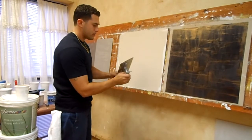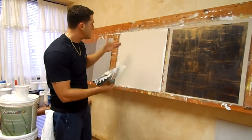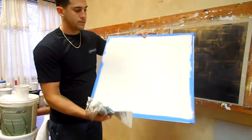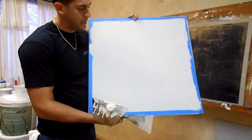Now we're going to wait until this dries. I'm going to do a second coat on it, burnishing it up. Basically when this dries, it will look like this. If you notice, it dried about 40% lighter — anything with lime dries 40% lighter.